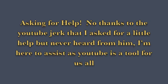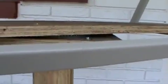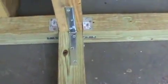I am finally finished with the tracking portion of my solar panel kit. In case someone wants to know how I did this, here's how: I took the frame from the solar panel kit and mounted it to a piece of wood on both sides. Then I took a piece of wood from one side to the other and bolted it down with wood nails. After that, I took the Lazy Susan — you can see it underneath there — and mounted it to the top portion of wood, with a smaller bottom portion of wood below it. I mounted that to two 2x2s and extended it from the base all the way down to the actual base of the stand.